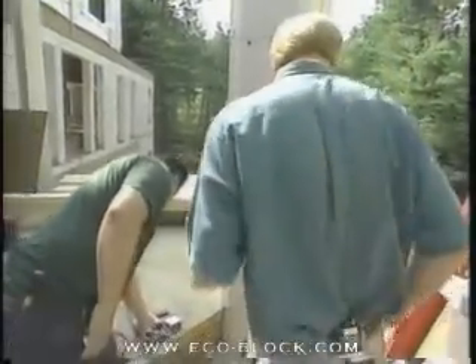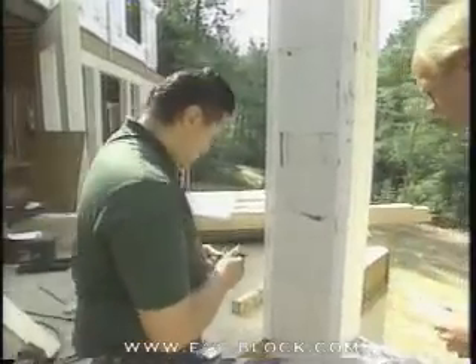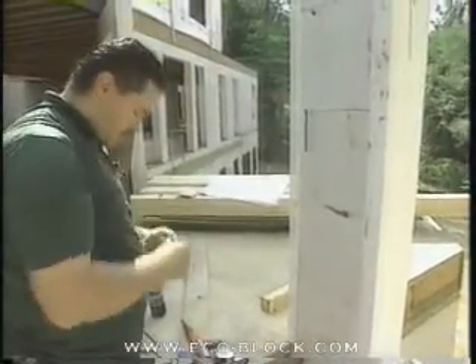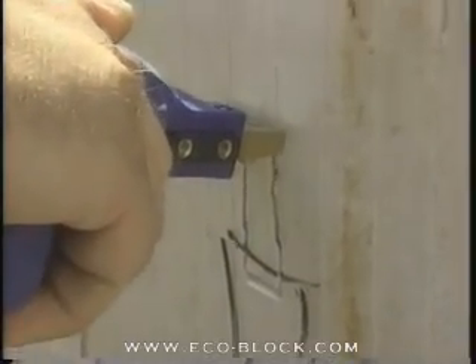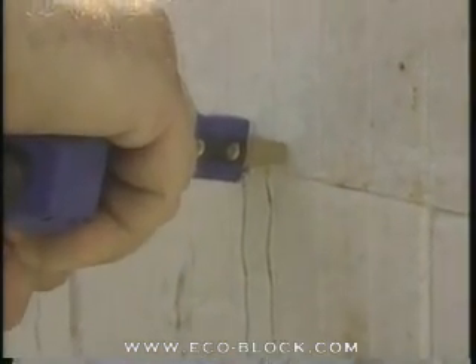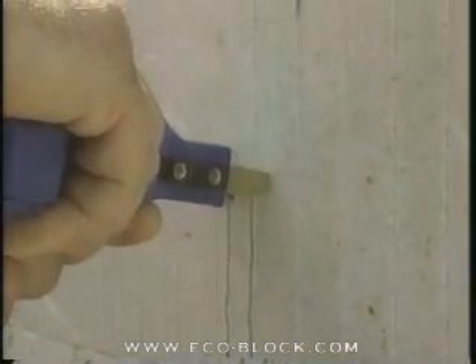We mark the height and then channel it. We basically use 15 inches as a standard for the bottom of the box, so the box will be in this area. I'm just going to channel down the wall and make a groove for the wire. You should go back as deep as you can to protect the wire — you want the wire sitting pretty deep in the wall. That way, if anybody hangs a picture, they're not likely to drive a nail or screw into the wire.